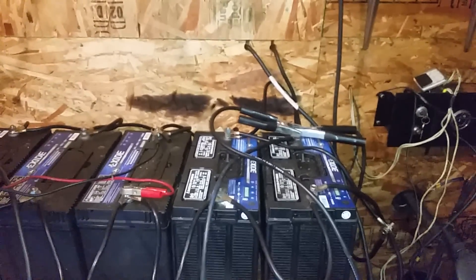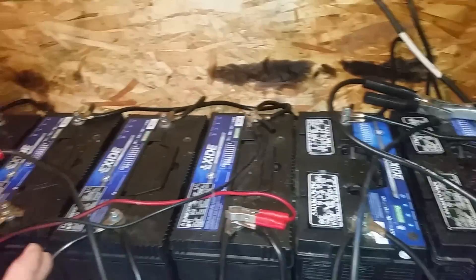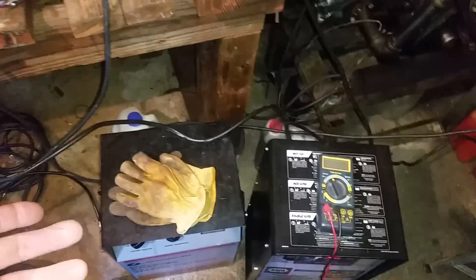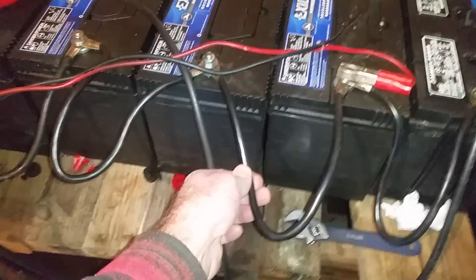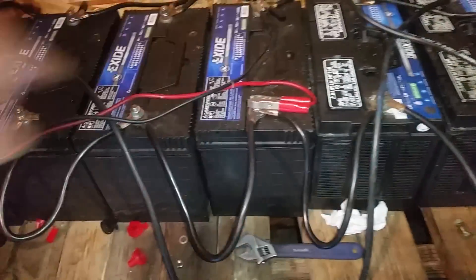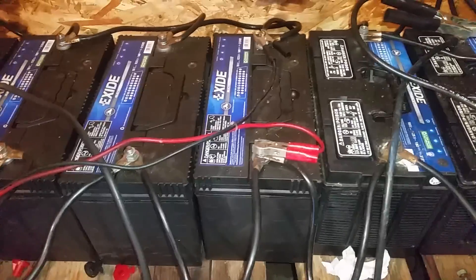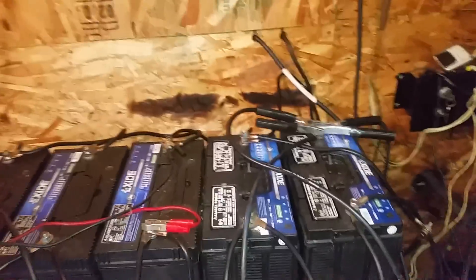It's for this off-grid system for a friend and it was put in 25 years ago. When I came up here today none of the batteries were balanced. They had two chargers here but were only using one, so I've got 80 amps going on the batteries now. For whatever reason they were pulling their tap going up to the house from the middle of the batteries rather than taking it diagonally across. So I got rid of some unnecessary jumpers that weren't doing anything and I'm cleaning up some terminals, still trying to figure out where some of this stuff goes.